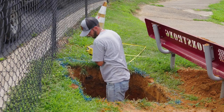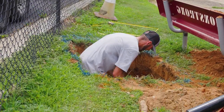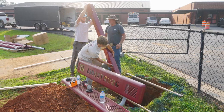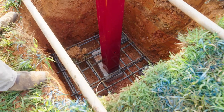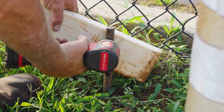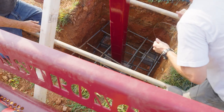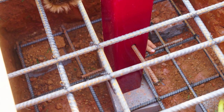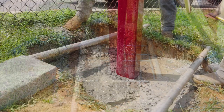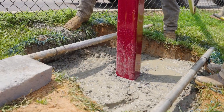Step 2: Set the column. Place a concrete block at the bottom of the footer hole where the column will be placed. Add rebar to the hole per the installation packet's instructions. Next, place the column on the support block and lock and brace the column to ensure it's level and stays in the proper position. Suspend the top piece of rebar and add rebar to the pre-drilled holes at the bottom of the column. Pour the concrete around the column until it's 6 inches below grade level, and allow the concrete to cure for a minimum of 48 hours.